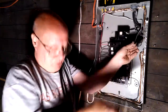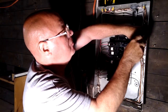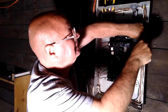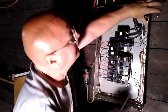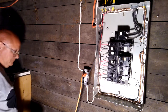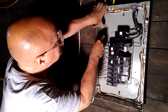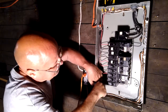This is number 10, so let's strip with our number 2 rule. We will put our 30 amp breaker down here — you can see it says 30 on the toggle, so this is our 30 amp. Put it down here, push it in until it's in the off position, push this back, bend it down, and we'll bring it down this way, then go over to our breaker.